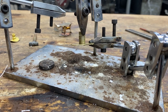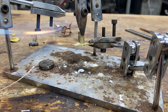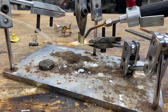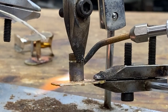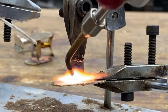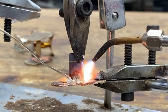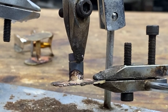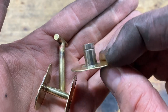We're going to add flux, and this time it's going to go faster because they're both considered thin-walled or thin tubing, so I won't use quite as much heat. I'm going to start it in the back, bubble that flux, come working it around. The wall of the tube is thicker than the brass, so I am giving it a little more. That's all it took — let that cool. After we get them cleaned up a little bit and roughed out, there's our little socket and flange brace.